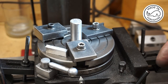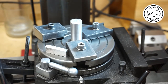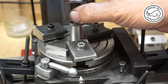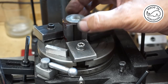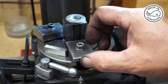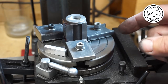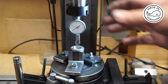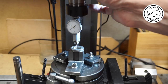When we made the cylinder we used this piece of aluminium bar. I'm going to use it again to help me centralise this on the rotary table. It's pretty close — there's a bit of give at either side — but I think I can sort that out by putting these clamps on. It took a while but I got there in the end — it's within a thou, so I'm happy with that. This is the end where the piston rod goes — need to remember that.